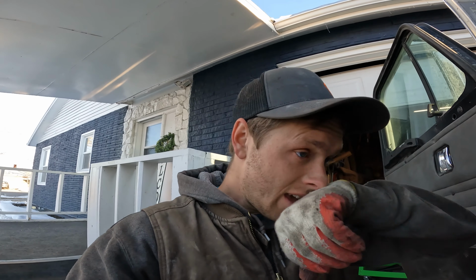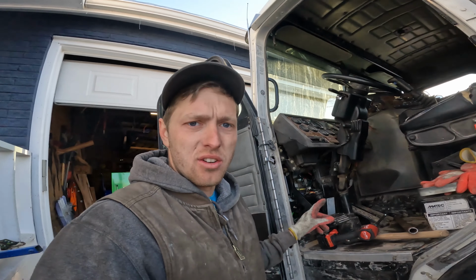Got the back side adjusted, probably as much as it can. I tapped it out on that, so I've got to do some adjusting here in the cab. It's tricky because you're not gonna be able to see it. Because it got so rough, we were in a bad spot, and so I slammed on the clutch and it bent the back part of the clutch pedal assembly. So I'm gonna try to bend it back. Because it bent up a little bit, that's why it's out of adjustment so bad.